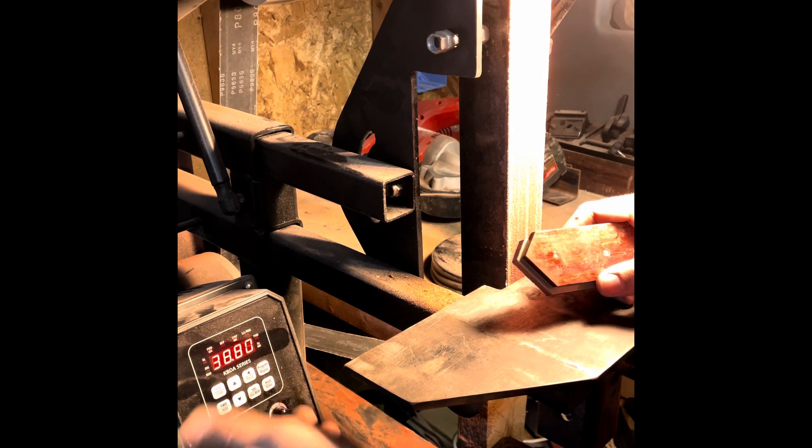If you have a small gap between the handle and the blade that you want to get rid of — we already know the knife blade is pretty flat and true, so something's on the handle side. If you have a disc sander you can move it back and forth on that to make it flat. The rudimentary way is to put it on something flat with sandpaper and move in a figure-eight motion — that will sand all the corners and apply equal pressure.